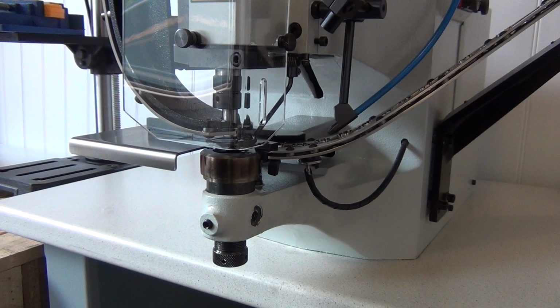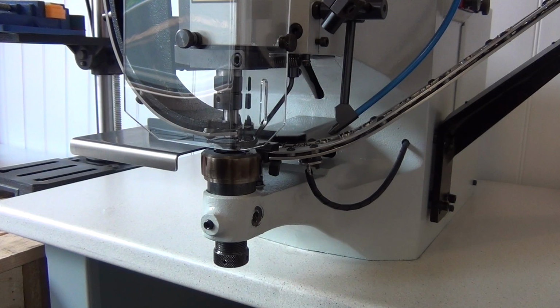One of the dangers present in shipping is that a loose bottom die could end up in a position where it is striking the punch hard enough to break the material cutting blade. This would then require replacement of the bottom die. Another possibility is a top die which is either not closing the setting adequately or is crushing the eyelet set. The simple answer here is to go through the die setup procedure before running the machine.